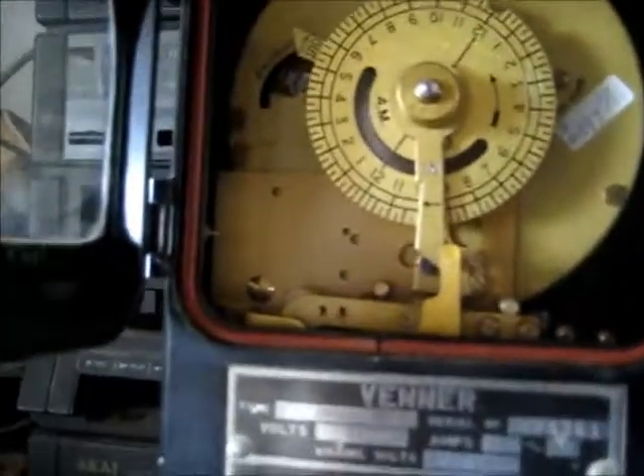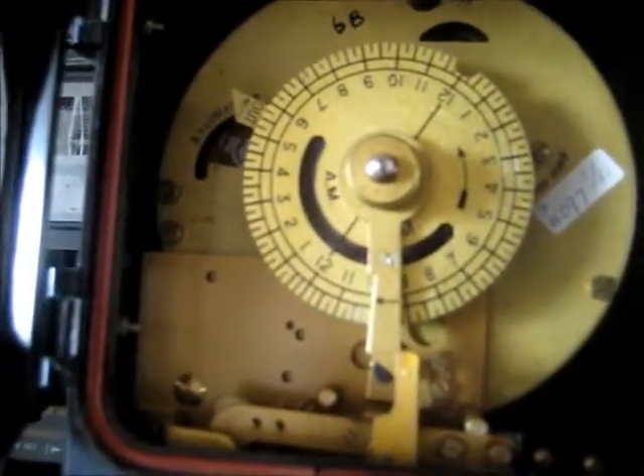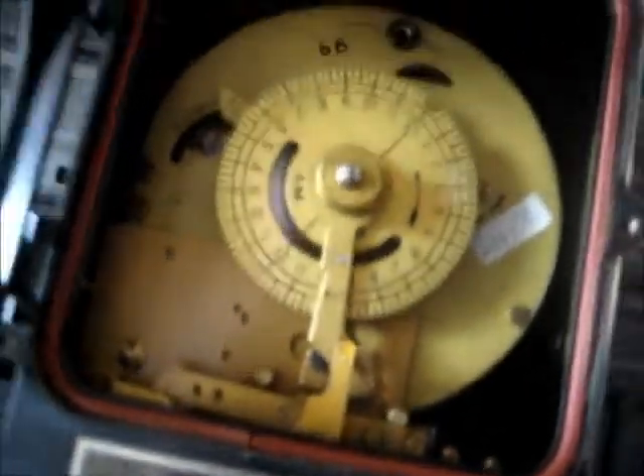It is working — very, very quiet. I can just see that wheel turning. I'll shut this so I don't touch it because it's not earthed — there's no actual connection to earth, so it has to be closed for safety. This other unit only has an earthing arrangement here where you plug the earth in and it grounds the chassis. This one doesn't have that — not even on the outside of the case. There's nowhere to put an earth.